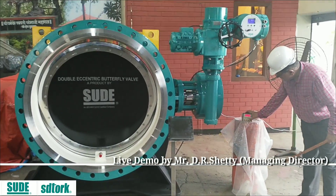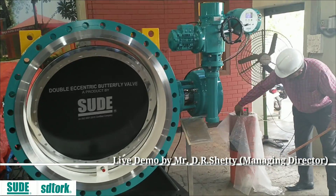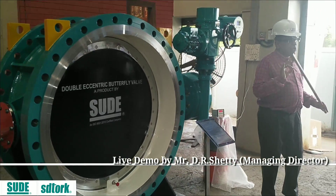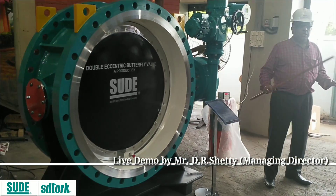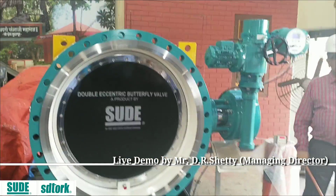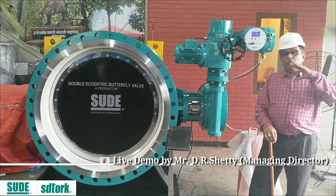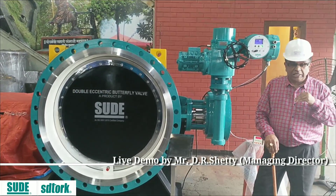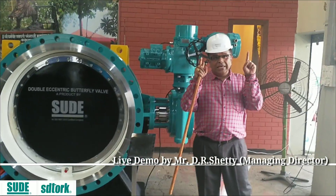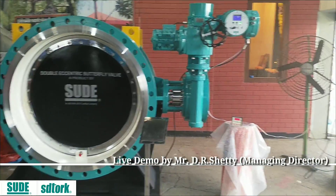Do visit us and you can see this product in live demonstration. As we said, the tight shutoff — we can use this for vacuum duty, we can use this for high temperature duty. At this moment it has EPDM seating. I can change this to a vacuum-rated or silicone seating, or even go for a high temperature special PTFE seating, which is called DRS seating. Please grab one of our catalogues which will give you all the details. You can get the catalogue from our exhibition hall.